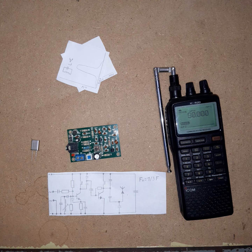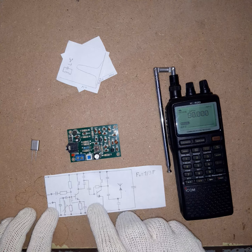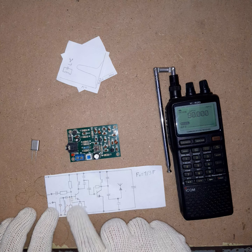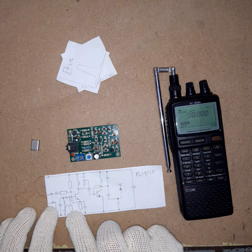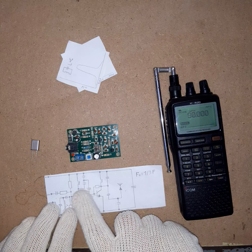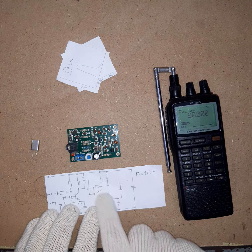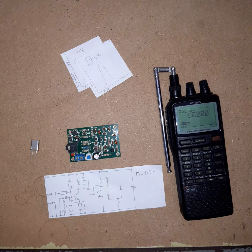This one easily goes as loud as a regular radio station. Here's the schematic, and you can see how they made it. They have the oscillator here, and this is the coil with the many turns. This is this one. And the more turns on the coil, the lower the frequency. So this oscillator runs on like 30 megahertz, and here is a filter. And this filter, just like on the crystal oscillator, filters out the frequency for the FM band. Then it goes to an amplifier, and again we have a tuned circuit, coil and capacitor, allowing the FM band frequency to pass while suppressing other frequencies.